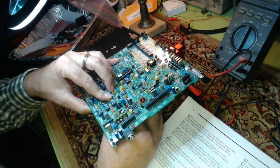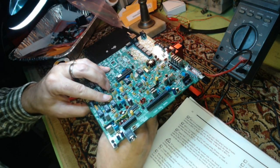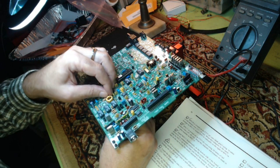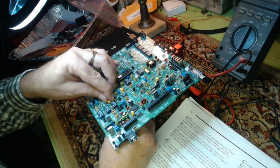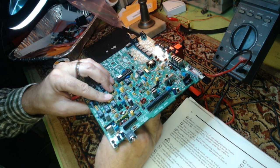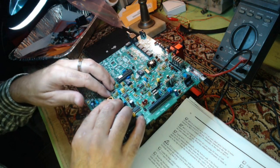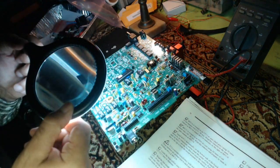Now this direction, a screw actually goes through the middle of this, a nylon one. And it wants you to screw it down before you solder it. And the last time when I screwed it up, what I realized when I put this in the board the first time was the wires on the secondary winding were crisscrossed, and they were crisscrossed because I had gone in the wrong direction on the primary winding, and it put a slant in the wire, and they really didn't go in between them. They crossed over them instead of going in between them. And they all look in between now.